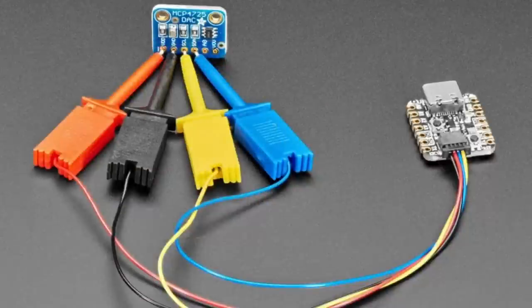They're not the ultra high-end, super expensive ones that you get on your $300 Logic Analyzer. These are the ones you get on your $25 Logic Analyzer. That said, they work perfectly fine. You can attach to DIPs, breakout boards, wires, headers, SOICs, not TQFPs, or obviously anything leadless, but SOPs or SOICs, yes. So even on a motherboard, if you can attach to some points, you can maybe get into that I2C there.